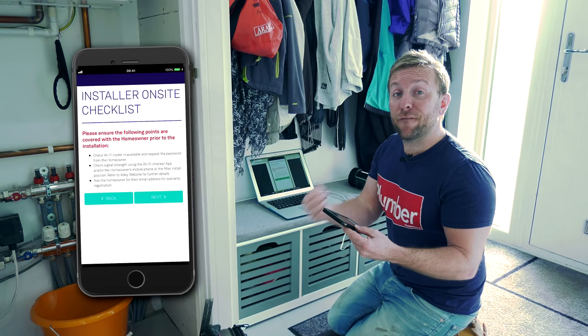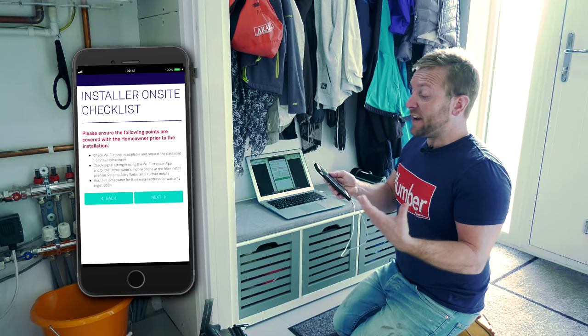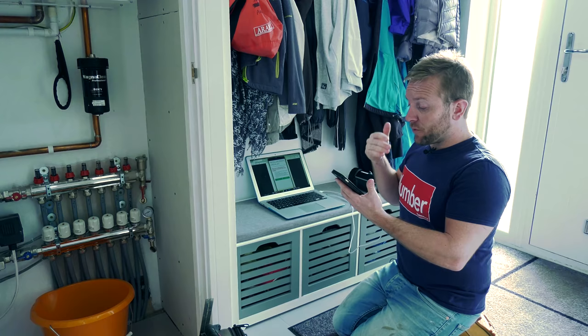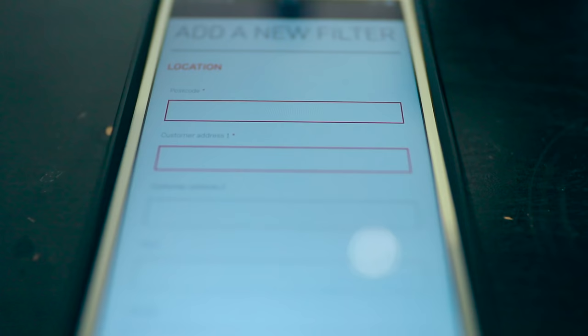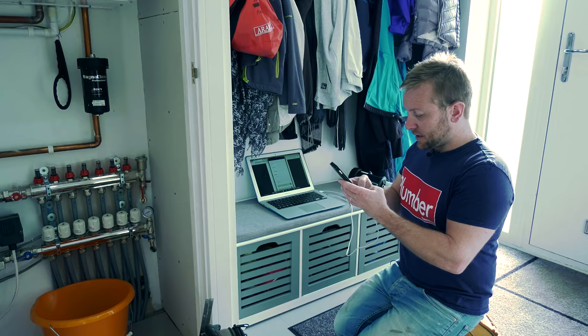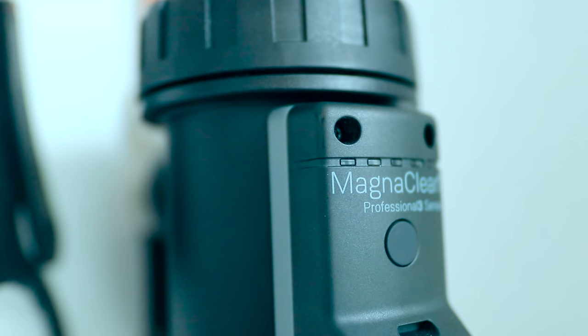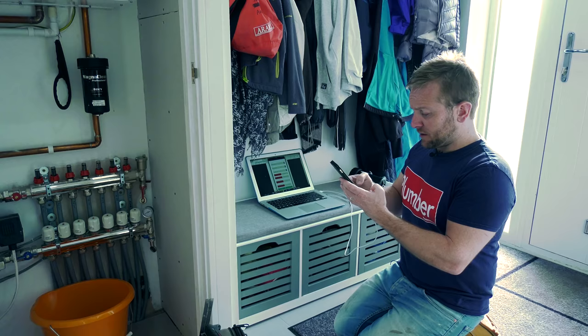Make sure you've got a really good wireless connection — you can see that on the signal bars on your Android, iOS, or laptop. We'll also ask the homeowner for their email address for warranty registration. We want to put the location in, and then we give the filter information about the system it's actually going to be installed on: number of radiators, type of materials. We also add the boiler manufacturer and whether there are certain types of controls. All these bits of information are handy for you as a plumber, because you can check all this stuff from your phone or from your AD Pro desktop back at the office.